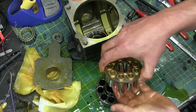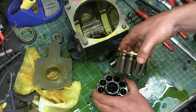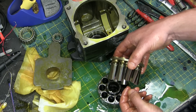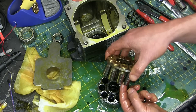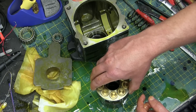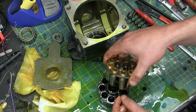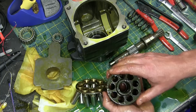As it completes 360 degrees of revolution, each piston has gone in and out one time — and that is how it pumps oil. Not much to it really. Now, these pistons, unlike pistons in a car or a hydraulic cylinder, there's no seal whatsoever. The reason these pumps cost so much is because the clearance on these is critical — they have to be perfectly sized so that they slide properly, but the clearance is so low that the viscosity of the oil itself is what provides the sealing.